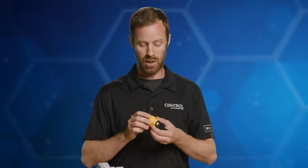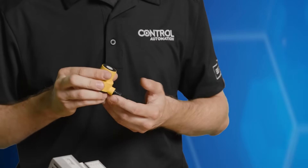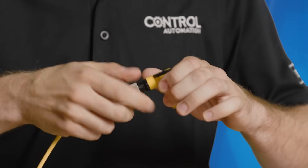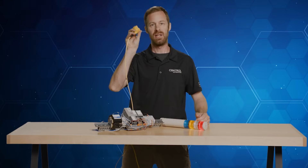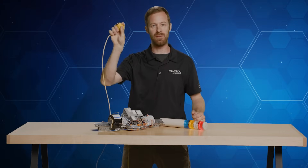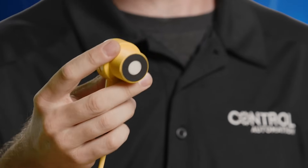Since this sensor has both analog and discrete outputs, we have to examine the wiring to properly install it into a system. To connect an analog ultrasonic sensor like this, they commonly use what's called a quick disconnect, or QD cable. These have four or five pins and they're keyed so they can only be plugged in one way. Two of these wires provide the power and the common ground signal connecting it to the power supply. As soon as power is enabled, we can hear that high-frequency train of pulses allowing the sound to echo off of an object. The other two wires contain the discrete signal and the analog signal.